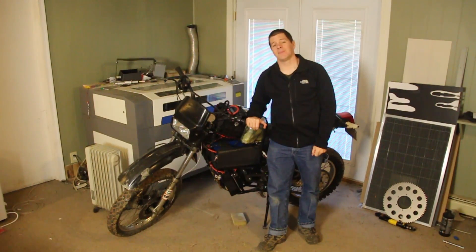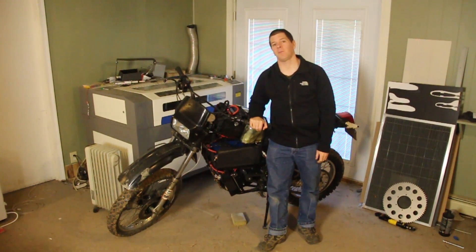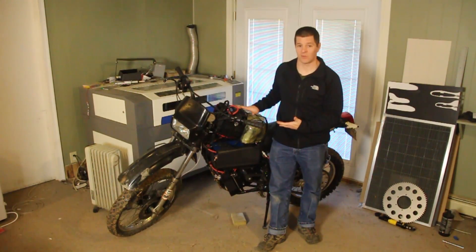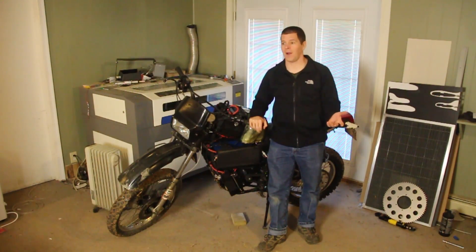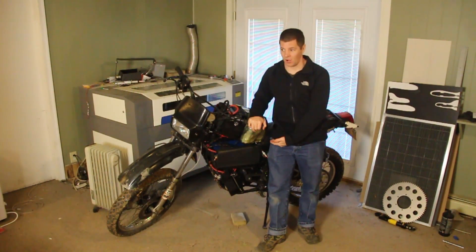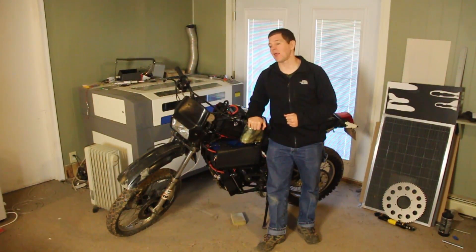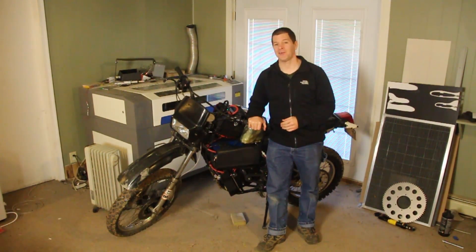Lesson number ten: there's a lot more to it than you thought. You might be the best planner in the world, but if you've never built an electric vehicle, there's a lot more to it. You're going to learn things along the way — like, I didn't know I needed a 12-volt converter to convert my 72 volts down to 12 for my lights, or that I needed a master fuse or a high-voltage contactor rather than just a switch. There's a lot more to this than you initially think, but most of those lessons are taught pretty easily and painlessly.